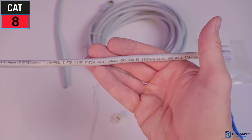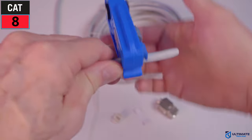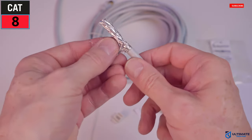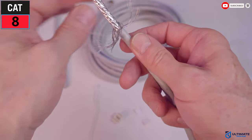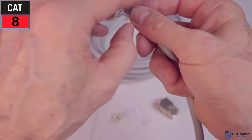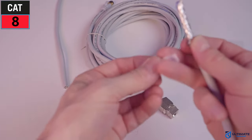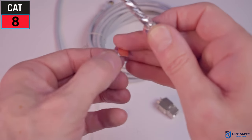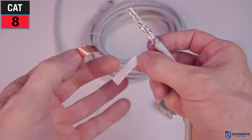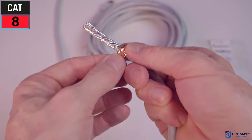We're going to use the same wire for this installation. Strip the wire back about an inch and a half, give it a few turns, and the wire should be cut. Remove the plastic sheath — you can now see the braided metal foil wrap. Pull all the metal foil wrap down but don't remove it. Instead, twist it all together, wrap it around the patch cable, and secure it using the copper tape, which grounds the wire to the cable. Attach the copper tape as tight as possible.